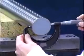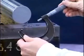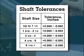Now ensure that the shaft is within commercial shaft tolerances. Due to our adapter mount design, standard commercial shafting tolerances can be used. This chart reflects the recommended tolerances. We'll be mounting a 2-7/16 inch Imperial Bearing, which requires a shaft diameter of 2.4375 inches, plus zero, minus three thousandths of an inch.